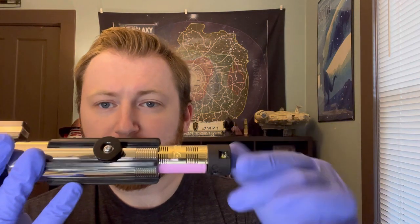I'm going to go ahead and pop this into the hilt. One word of caution: if you have this hilt or something similar, I would always recommend against having the chassis on while you're inserting it, because for this particular hilt you've got a bit of a lip inside. You're going to insert it and your chassis is going to hit that lip where the internal diameter goes down, and you'll have to navigate that. If your pins touch that lip you could risk short-circuiting your board. So I always have the chassis off until it's seated inside that lip, and then I'll turn it on.